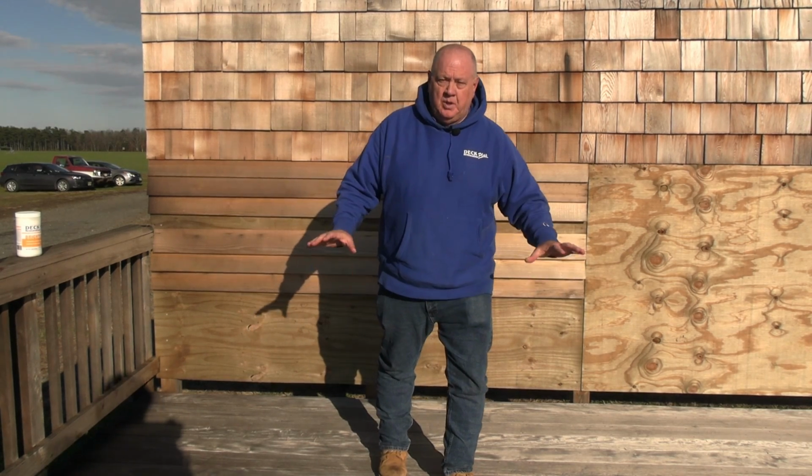If there was a lot of growth, the chlorine bleach would hit the growth, react with it, and be done. It reacts with the first thing it comes in contact with, so it doesn't really help with the restoring or the cleaning of the wood. So we clean the deck, but we really don't restore the wood to its optimal point and level.